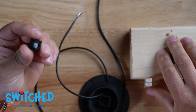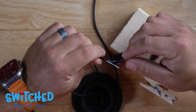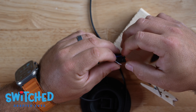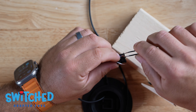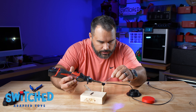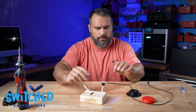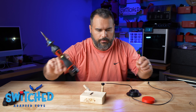Now we're going to solder our wires to our mechanical switch. I've got a block of wood and a clothespin to hold things in place. Take each wire and hook it around the two prongs on the back of the mechanical switch, looping it around and getting it as tight as possible. With the soldering iron heated up, heat the solder and melt it onto the wire making sure to make good contact with the post on the mechanical switch button. Do the same for the other side and solder that wire too.